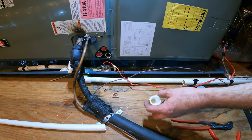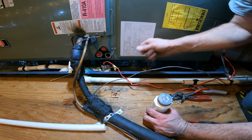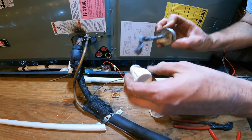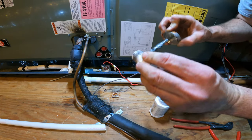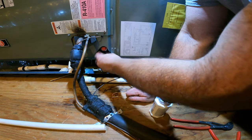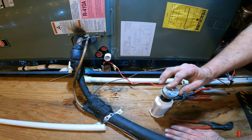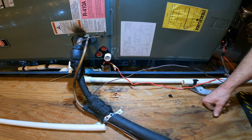I'm gonna add a little pipe sealant. Make sure there's not too much gunk in there. I'm just going to put a little in the threads — don't put it inside. So many times I go to a unit and find pipe dope floating inside the trap. You don't need it. A little dab will do you — anything past that, you're wasting too much.